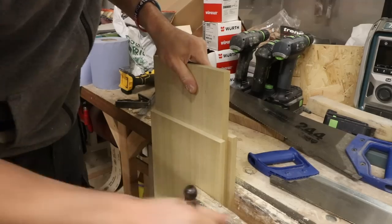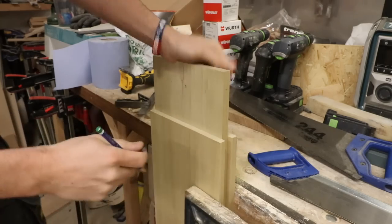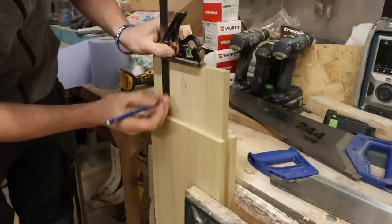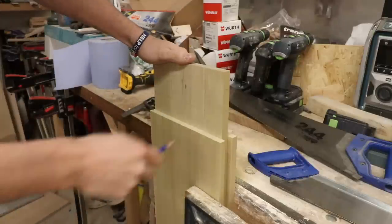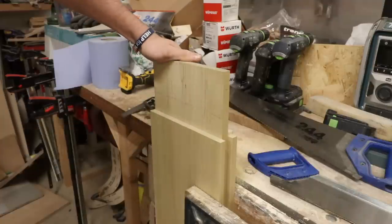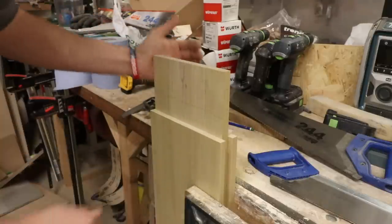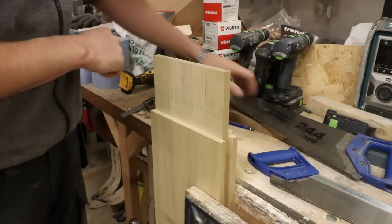Now pay real good attention when you get to cutting that you're leaving the tenons on your inside. It's a common mistake. I've done it several times. You get to this stage where you've machined everything in the workshop. You tell your mate, yeah, I'm done with the tenoner, and he adjusts it for his job and starts his job. You come here and you mark that out wrong in a rush, and you cut that bit off and leave that one and that one as a tenon. Then you go to put it together and it's completely ruined, because you've got no strength now in that door, because you meant to cut that bit away and that bit away. So really pay attention before you cut. Make sure that your inside edge is where your tenon is located and it works from there properly.